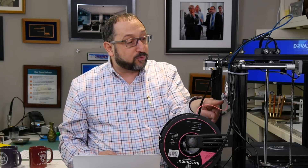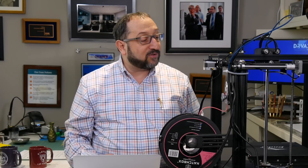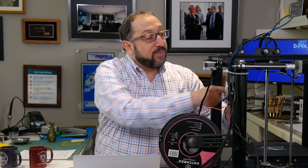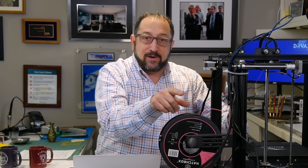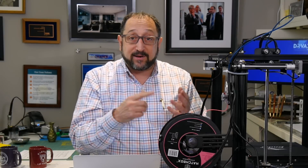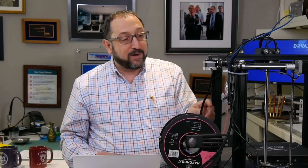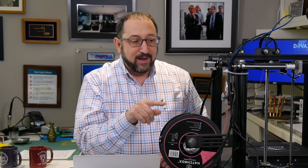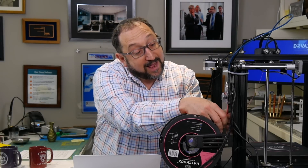We can see we are extruding filament — it's coming out of our nozzle here. There's a clean extrusion coming out. Now, this extruded length won't be 100 millimeters because we're extruding 100 millimeters of the original filament; the actual length depends on nozzle size, flow rate, and other factors. What matters is how much filament is pulled in — when we ask it to pull in 100 millimeters, does it actually pull in 100 millimeters? Since the F command was F100, it's going to run for a full minute. Okay, it's stopped — we can measure what's left.